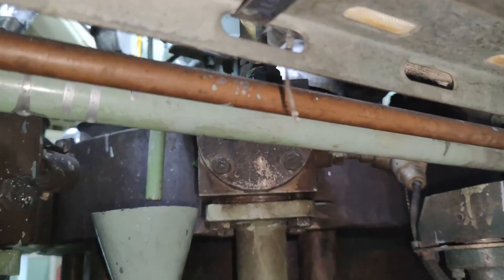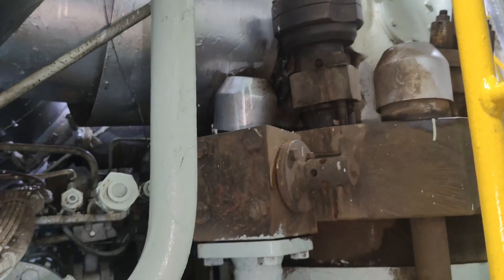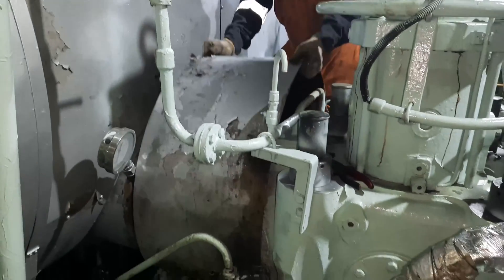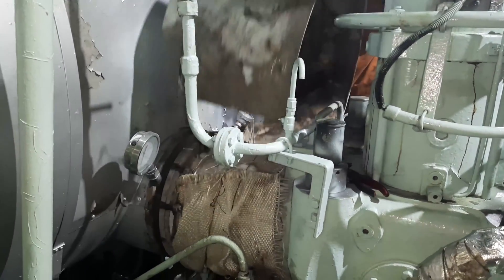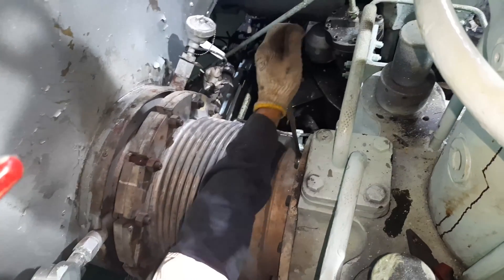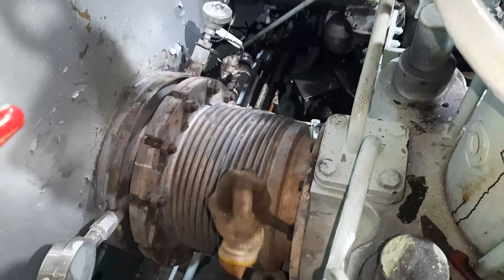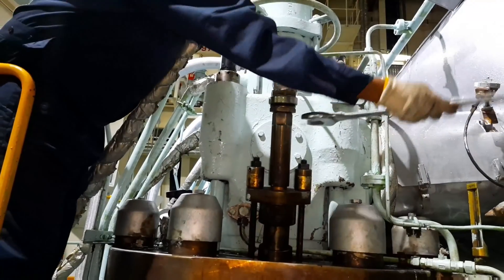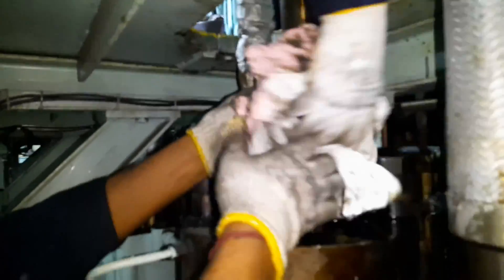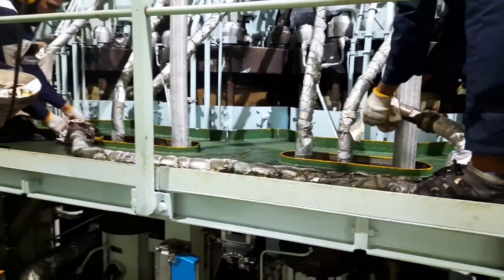On the turbocharger side of the engine, disconnect the jacket cooling water outlet pipe at the bottom flange on the cylinder head. Also disconnect the air connection pipe to the air starting valve on the cylinder head. Remove the protection jacket and insulation for the intermediate pipe, also known as the compensator. Loosen and remove the securing bolts on both the exhaust valve side and the exhaust manifold side. Disconnect both the fuel injector high pressure pipes on the fuel valve and fuel pump side. I have already uploaded a detailed video on the proper procedures to disconnect the high pressure pipes on a fuel valve — do watch that video for appropriate techniques.